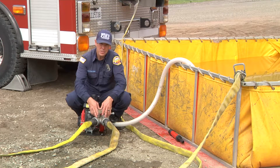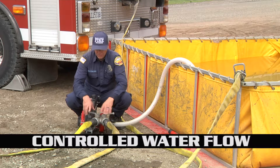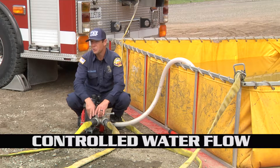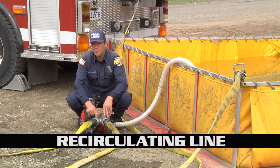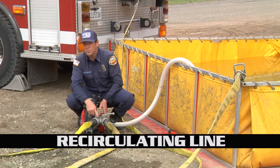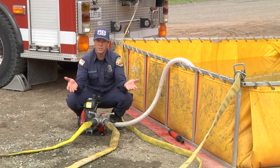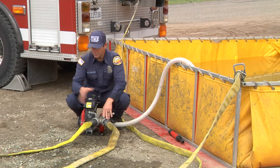With the Y itself, there's a reason obviously why we have it. Number one, when we're opening and closing valves we can do that and have a little more control, other than just having an open discharge as we would if we were drafting — everything is opening and closing slowly so we don't lose that prime. The other reason is when we are supplying rigs and just waiting, we don't want to lose prime and we don't want to be deadheading the pump and heating it up. We have the recirculating line, like you would on a normal drafting operation. The inch and a half goes back into our water source, and the other inch and a half is supplying the rig.